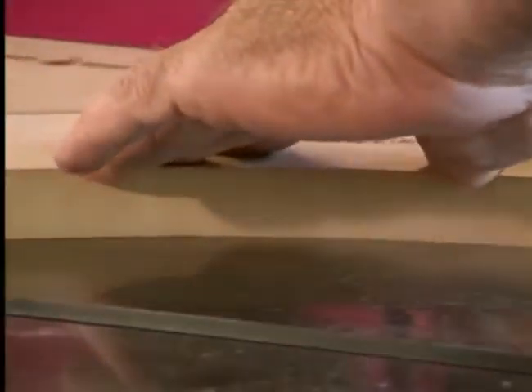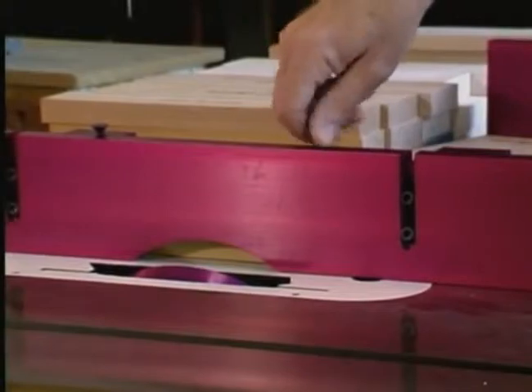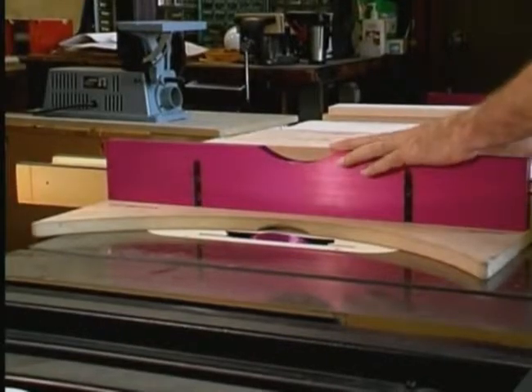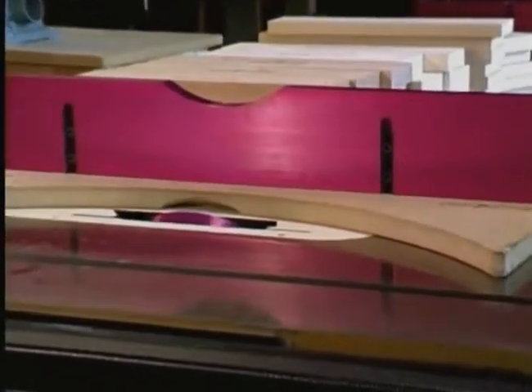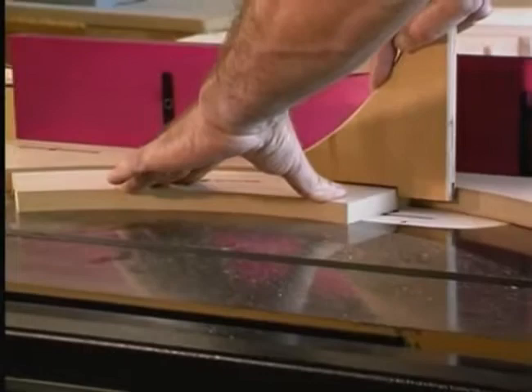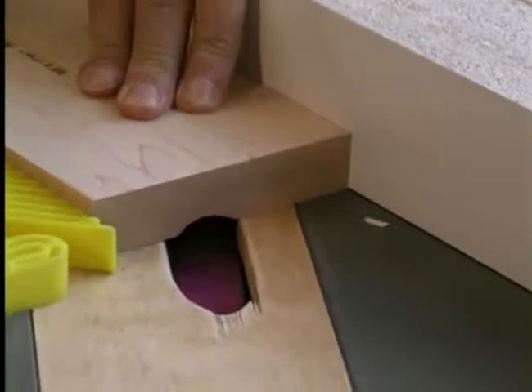You can also use your Magic Molder fence to cut patterns in arches. The Magic Molder fence has four holes that have been drilled and tapped with standard 1/4-20 threads to enable you to attach an arch template for cutting curved moldings and casings on your table saw. You make your own template to whatever radius you need by cutting arches to size with either a bandsaw or router. You then run your arches through the template over the Magic Molder. You can also cut wider molding by merely clamping a fence at an angle on your saw, and the angle of the fence will dictate the width of the cut.